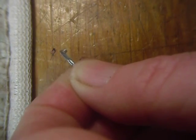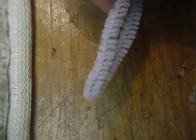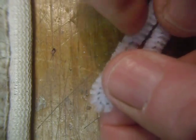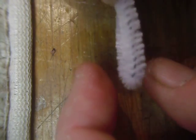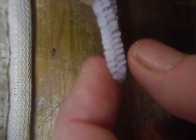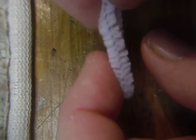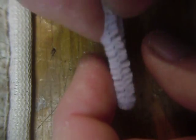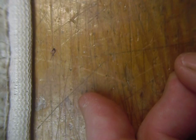I just repaired the one I found to be defective. The other thing I didn't go into is cleaning the encoder disk in the IC-211. To clean the encoder disk, I used thin pipe cleaner — the kind you get at a craft store, real small and fluffy. I dipped it in alcohol, slid it in between the encoder disk and the circuit board where the sensors are, and rotated the disk while moving the pipe cleaner back and forth. I did that two or three times on both sides of the disk. Just wiggle it to get it in there — don't force it. Get those sensors clean, get the little LED lights cleaned, rotate the disk, clean the disk, then blow it out with a small air compressor commonly used for inflating air mattresses.